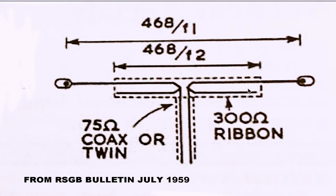What we'll do is make that slightly longer so we can trim it back. Assemble the antenna with a section of 300 ohm ribbon in place — I would suggest you make that about 5.2 metres long — then add the wire section, and good practice is to make that slightly longer than the calculation suggests. Once you've done that you end up with a dipole that covers 40 metres and 20 metres. They show 75 ohm cable, which goes back to 1959 when 75 ohm was the standard, but 50 ohm will do almost as well.